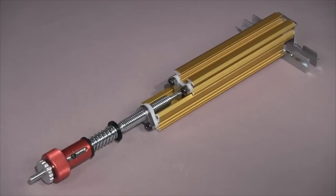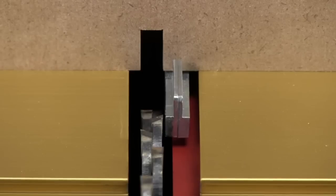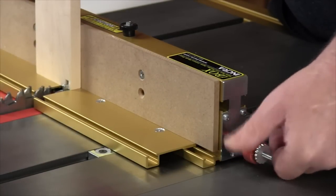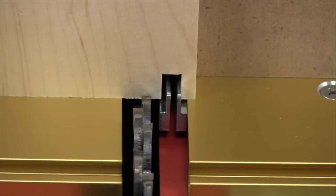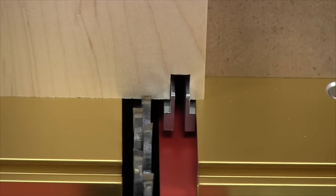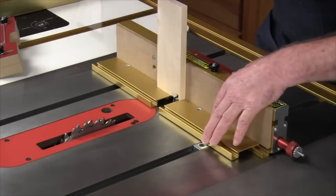But the real magic is in the iBox pin plate positioning mechanism. Just loosen the locking knob and zero the pin plates to your cutter — we call this KISS calibration. Then simply turn the red knob to adjust the pin plates to fit a test cut made with your blade. The iBox's dual pitch lead screw based positioning engine does the rest, simultaneously setting the all-important correct distance between the pin plates and the blade. Tighten the locking knob and you'll be ready to cut some perfect fitting box joints.